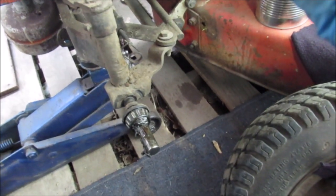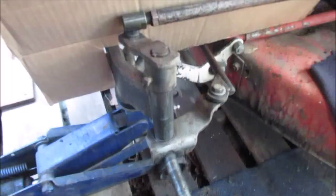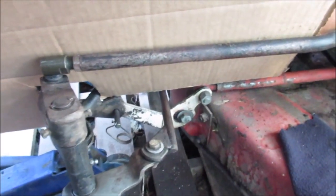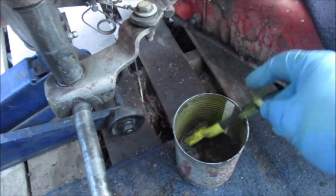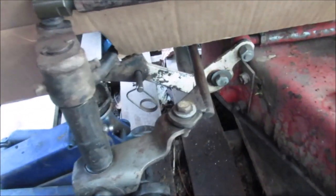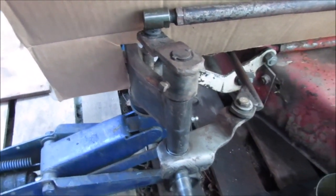Let me take my good hand — I'll hold the camera. We'll shut the camera off here and get back to work. We'll soak everything in gas except the rubber parts — don't soak them in gas, just wipe them off. We had enough — didn't use a whole lot. A little on the wire brush. We use these cheap wire brushes and then a rag soaked in gas, then dried it off.